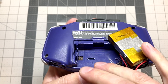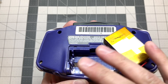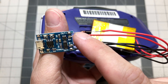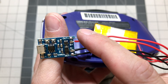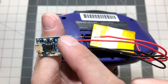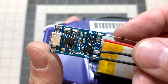I was doing some testing — once you get over 3.7 to 3.8 volts, it just shuts off. You lower it back down, it comes back on. So it's got some kind of over-voltage protection built into the system. Basically, you just connect the positive and negative of the battery to this board, and then out to whatever you're using it for. You charge it with a regular micro USB, and then the battery flows its current through the protection circuit and back into your device. So it's super handy, super simple, easy to use.